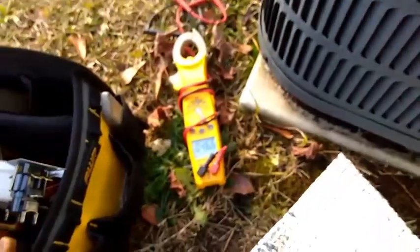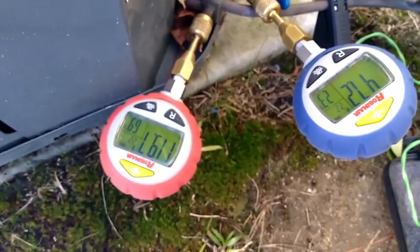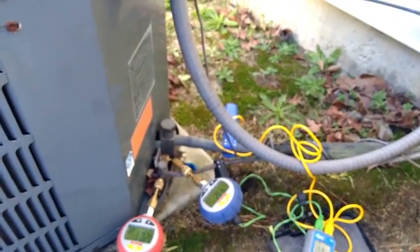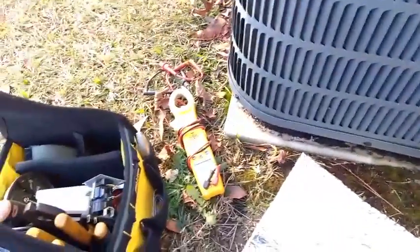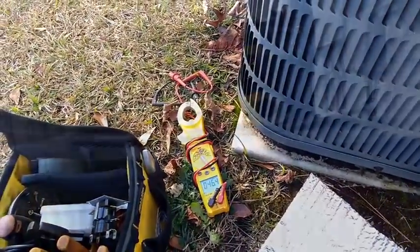It's a little cold for testing AC — 46.6 degrees in the supply, that's upstairs in the bathroom, about halfway across the house. 47.2 over 119 — very low temperatures because they have a 69 degree setpoint. It's about 10 degrees subcooling and a 30 degree superheat, a little bit less than 30. Not too bad really for a day like today because you're going to have a high superheat when it's so cold outside and warmer inside. I'm not actually alarmed by it running below freezing because it is so cold outside today.